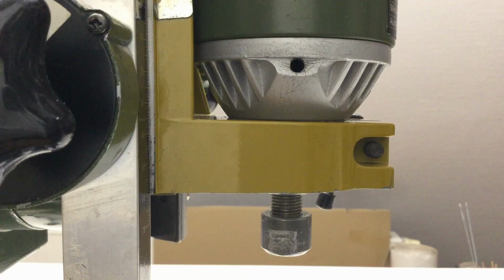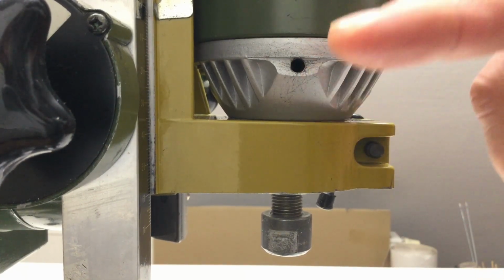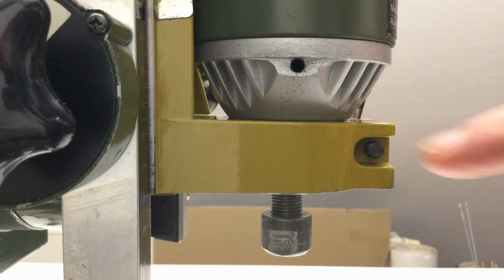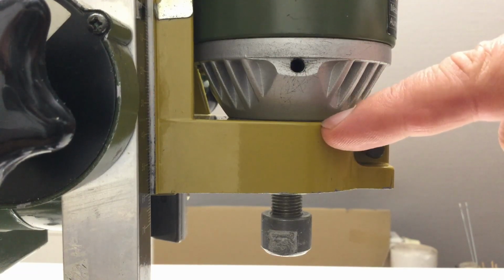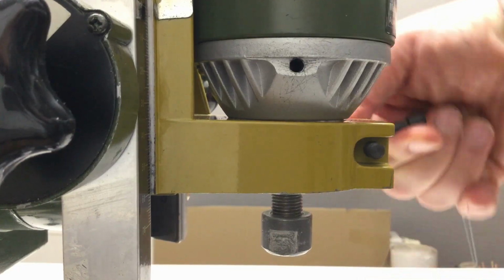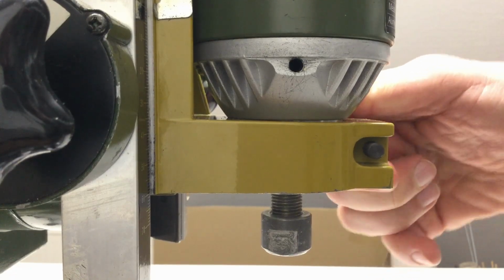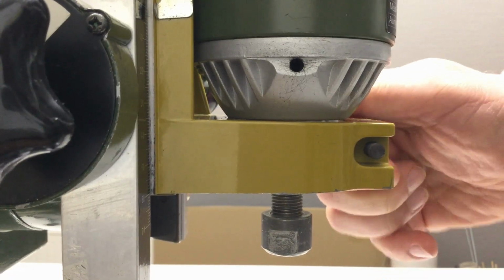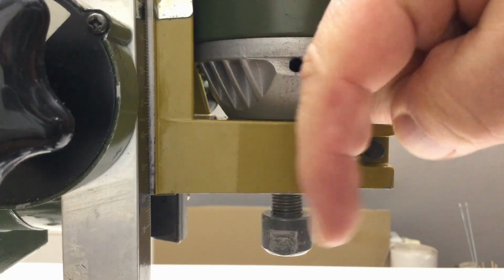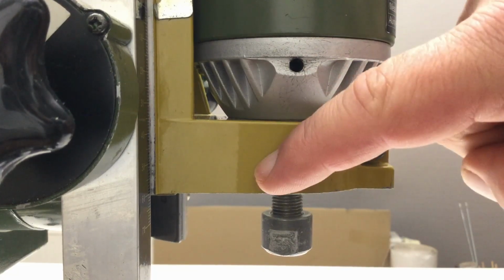And the first thing you should notice here, which makes things very complicated, is when I actually clamp the spindle in here, please watch that gap here. The whole thing tilts a little. But anyway, let's clamp that in and measure how bad it's trammed now.